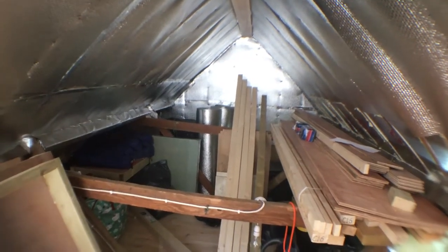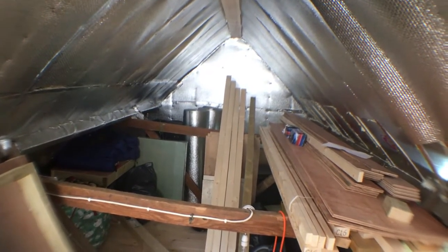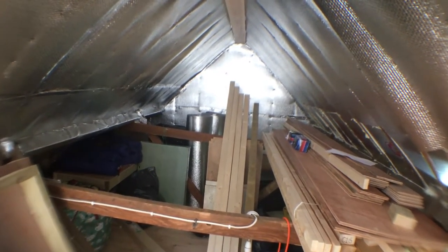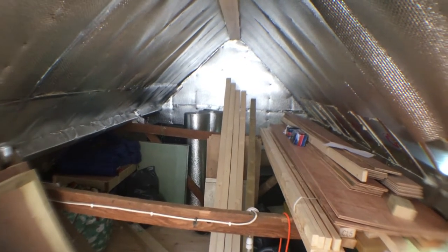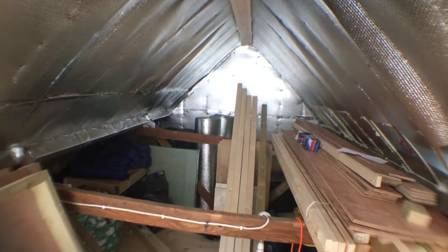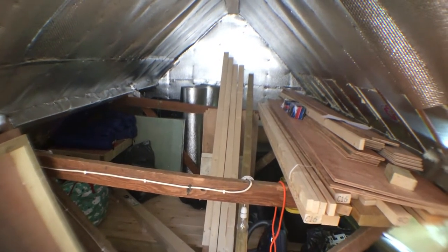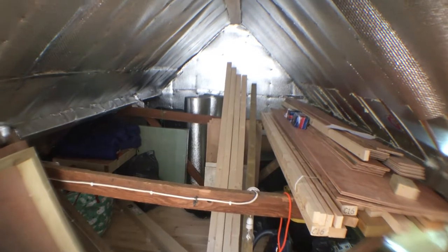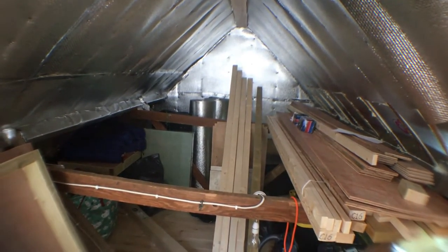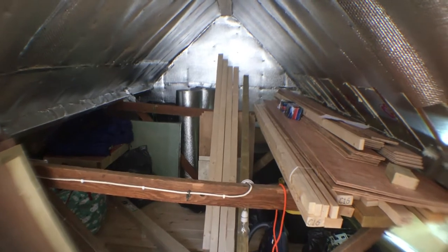So this is the loft layout. If you imagine a T — a capital bold T — I'm standing at the top of the T, at the crossroads, looking down towards the base. I have a gabled end with a height of about 2.4 meters, which is great to work in, and a pitch of about 42 degrees. The base at the floor is about 5 meters across, a little over that — 5.2 meters. The problem I've got is getting over these collars: do I build the baseboards above or below? Obviously every centimeter of height I put on the baseboard, I'm cutting off at least two centimeters on the sides — a lot from the width.